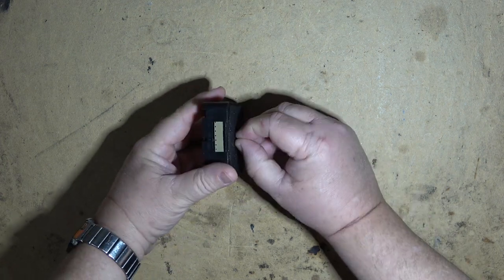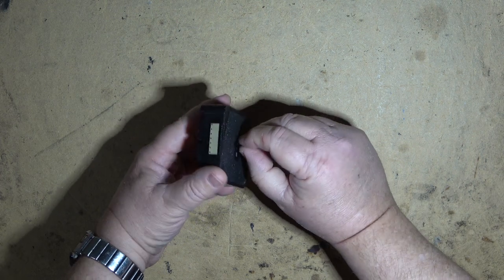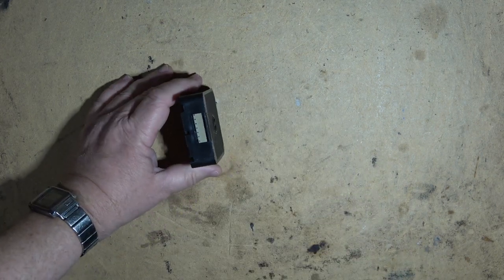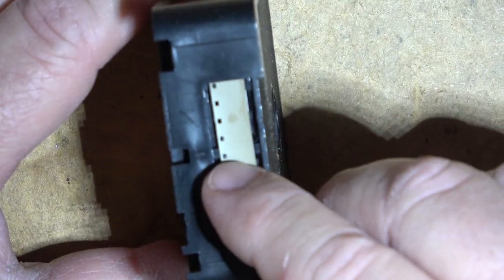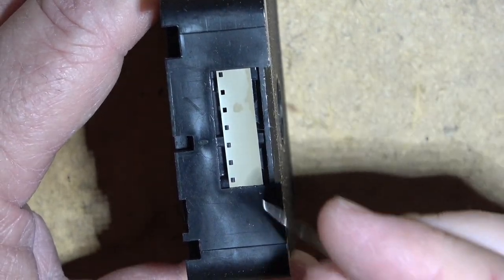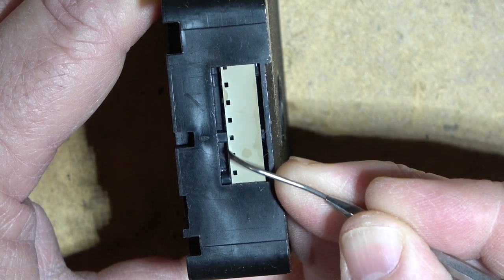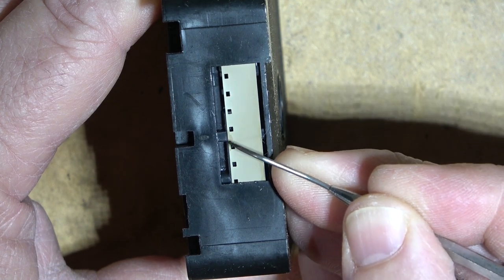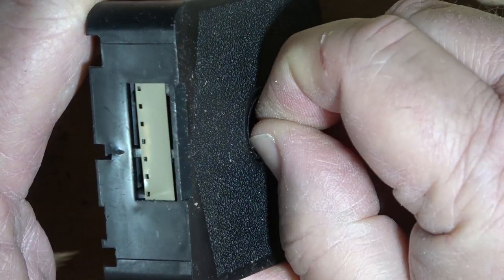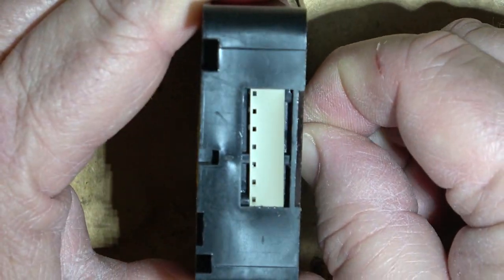These look like they're brand new and they've never even gone through the camera because they're not exposed. How the Super 8 camera worked is the lens was focused here, each one of these would be a frame, and as the camera was recording the gate would close and the finger would advance it one sprocket at a time. The film was pulled out from the canister so it could be exposed, and the motor turned the take-up.